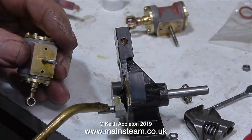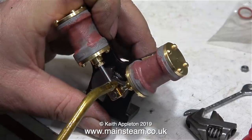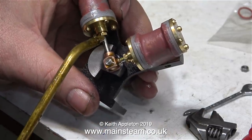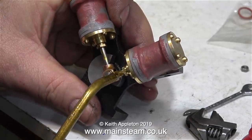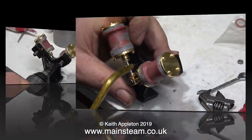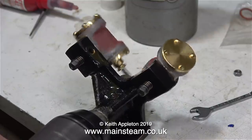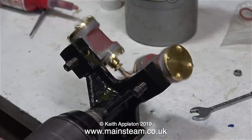Time now to fit the crankshaft. As you can clearly see from this clip, I'm making sure that everything is oily. I don't build too many oscillating cylinder engines, but over the years I have assembled and repaired the small oscillating cylinder engines that used to be made by Cheddar Models. Their assembly instructions tell you to assemble the trunnion pins this way. Apart from oiling the external parts of the engine, I also pumped some oil through the steam inlets on both cylinders. And now when I test run the engine using my trusty Dewalt drill, you can see some of the oil coming out.